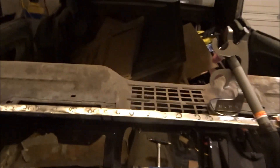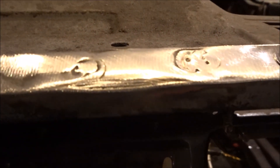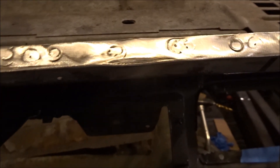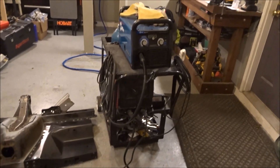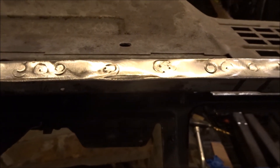I noticed an issue — I got a little crazy with my angle grinder and nicked the corner of this. You can slightly see through to the other side. This is a perfect time to clean that up and make it right. It's a sealing spot, so I've got my Lincoln Square Wave TIG 200 set up — I'll be doing a little DC welding on this to clean it up and shape it, and it should be good to go for strength.